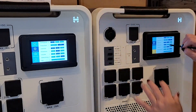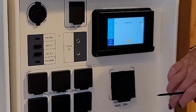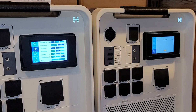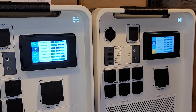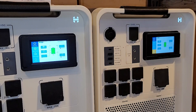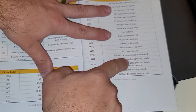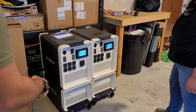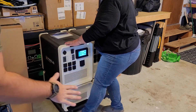On the second unit you'll see an alarm — click it and it will show error code W17, which means improper voltage between two units because both were at 120 volts and are now outputting 240 together. Click the flashing finger, click UPS, then go back to settings to confirm it's no longer flashing. Go to home on both units. The W17 'inconsistent parallel operating mode' warning appeared because we were switching from 120 to 240 for split phase. Now turn off both units using the green buttons on the back so all wire connections can be made safely without anything live.